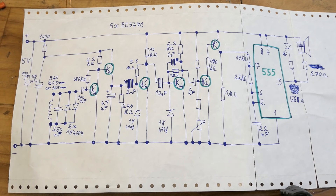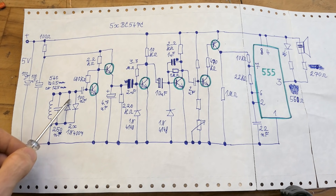Here's the receiver section, which for microcontroller digital enthusiasts might look like an absolute analog nightmare. Here's the receiver coil with the resonant capacitor. This resonant capacitor boosts the voltage almost 10 times and gives it selectivity — it selectively receives just the frequency of the transmitter. The capacitor is selected so that the resonant frequency of the receiver circuit matches that of the transmitter. There are also some protective diodes, two anti-parallel, limiting the voltage to about half a volt — their forward voltage drop.